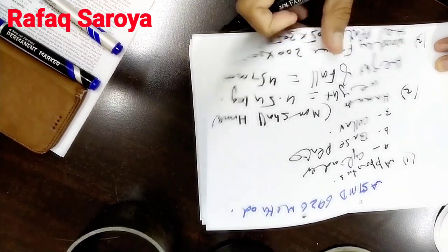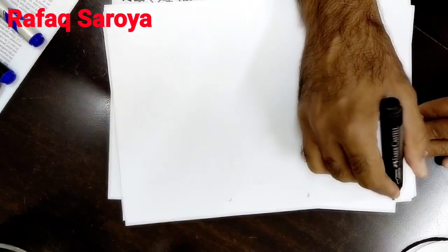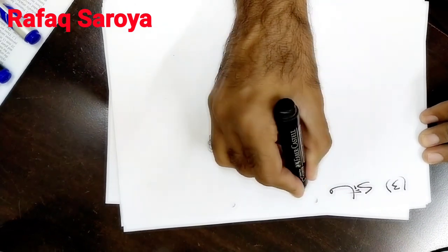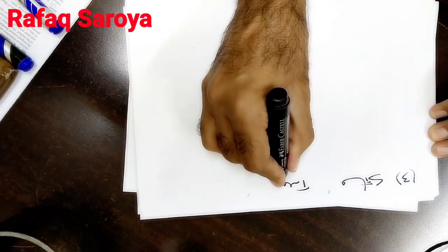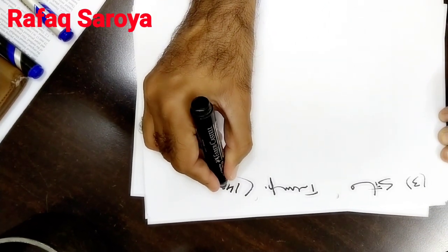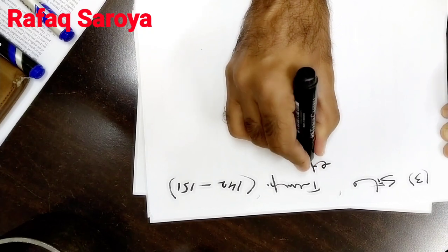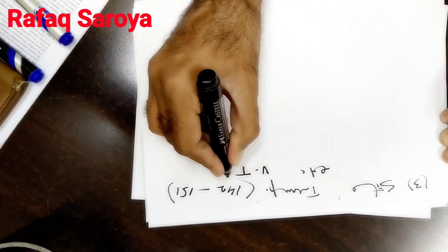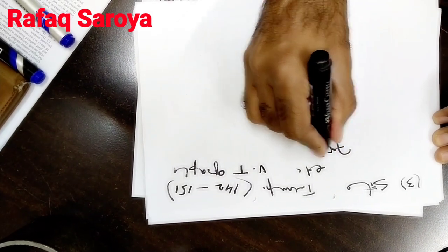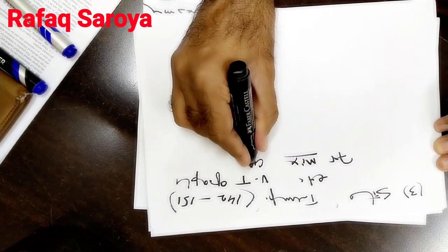After this brief introduction, the first thing is that the sample collected from the site should have a temperature within the range of mixing temperature — 142 up to 151 degrees, or whatsoever is obtained from the viscosity-temperature graph — for this mix, for compaction.